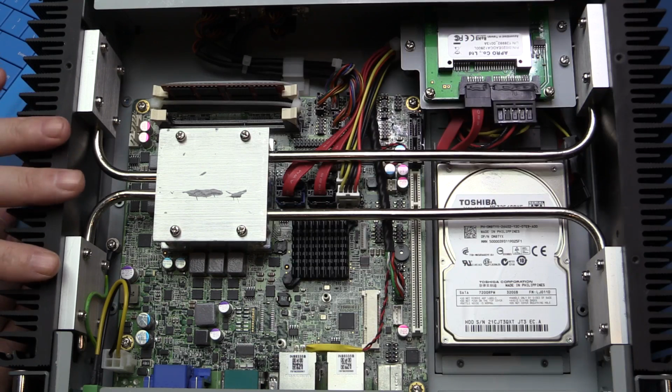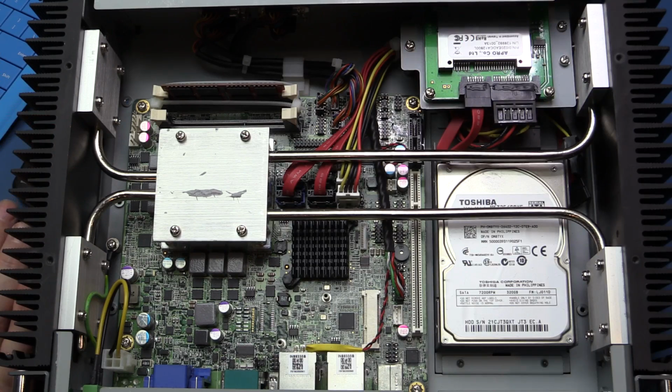This particular PC can come either in an Intel Celeron, an Intel i3, an i5, an i7 in an extended temperature range using the 22 nanometer Ivy Bridge processors, which will give you -40 to +85 degrees C, and another option, which is the INS8335A-ET, which gives you -20 to +70, which is more of a standard industrial temperature range.